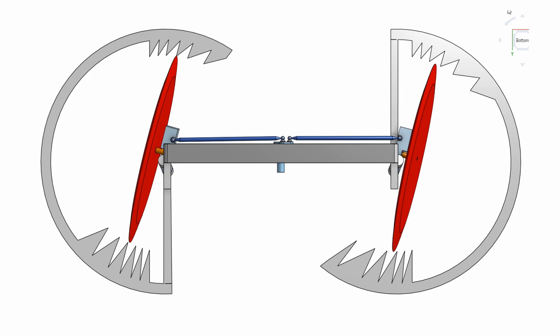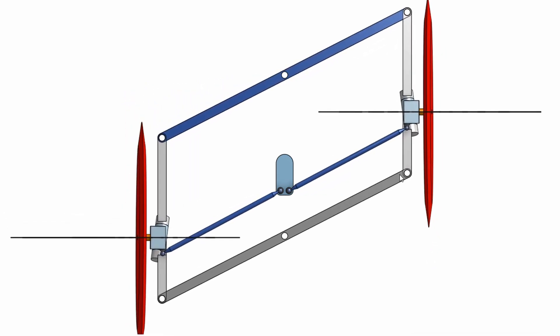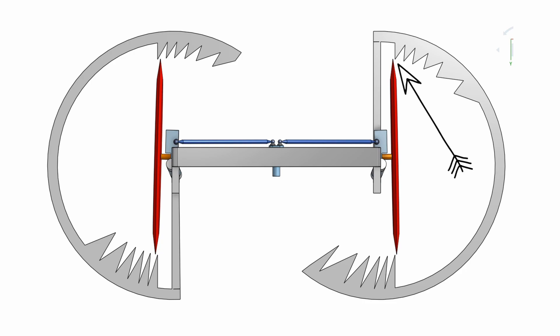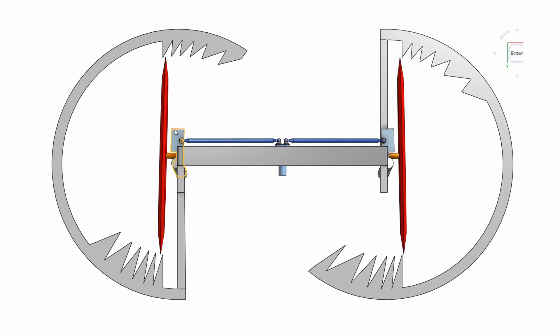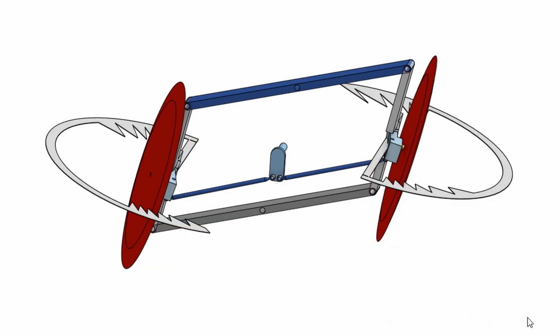We could adjust this by altering the various aspects of the geometry. Applying some tilt, you can see that with this particular arrangement the wheels are now toeing in even without steering. With steering also applied the wheels are toeing in significantly. What I've found is that the wheels are toeing in far too much, the tilting action is affecting the wheel angles, and the Ackerman geometry is not being followed very closely at all. We could change this by altering the length of the tie rods and the position of the outer ends of the ball joints on the steering arms.